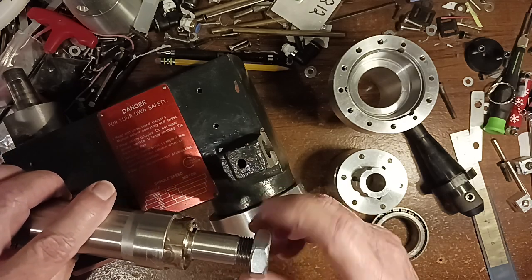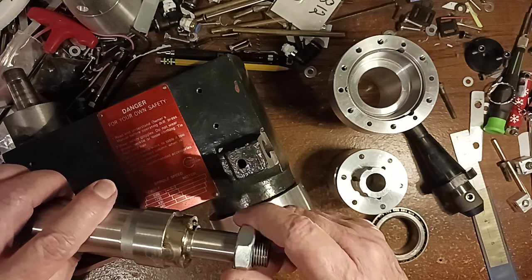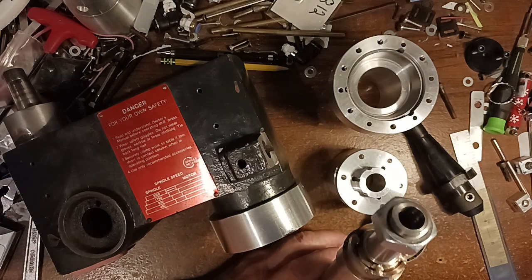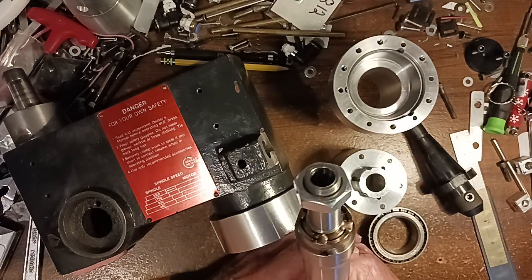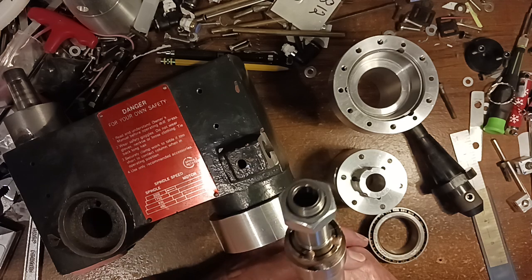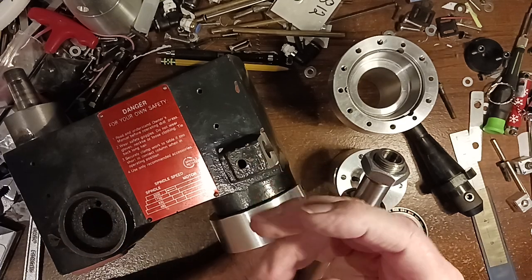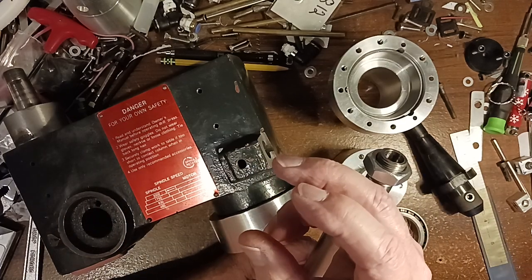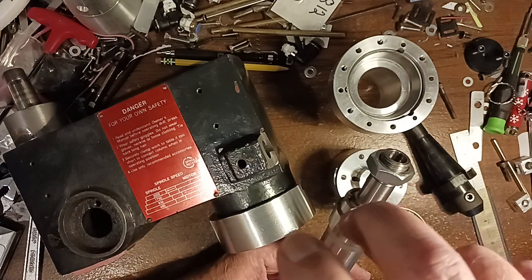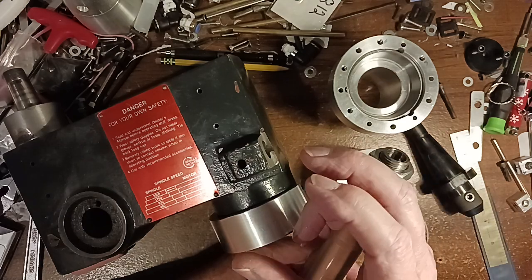I really didn't think it was going to work, because this material is stainless steel, and my little lathe. See, when I bought, it's not the lathe, it's the tool holder. When I bought the tool holder, they make two different types. They make a piston type, which has a little cylinder that comes out and it pushes against the tool holder from the centerpiece. Then they make the wedge, and they have slides on the wedge that when you lock it, it won't allow it to move.